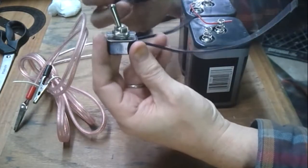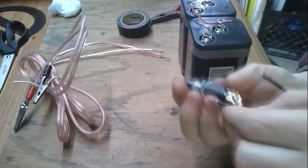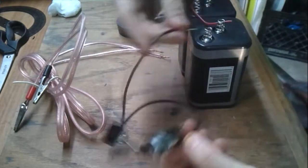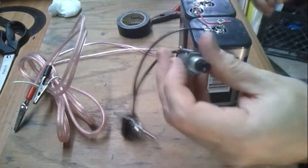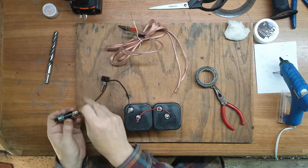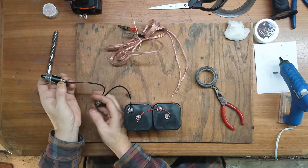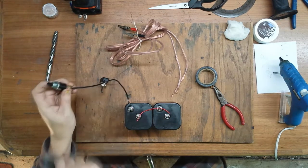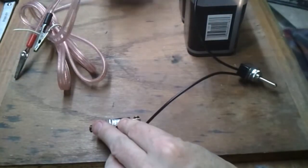Both of these switches are very simple two-wire switches, and basically I'm going to come out of one into the other. Now these two switches are in series — we can connect one leg there so the series continues. While the first switch is in the OFF position, we won't get any current through it, which prevents it from passing to the momentary switch that would close the circuit. From this switch we're going to connect the next wire.